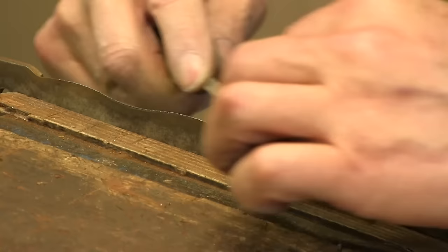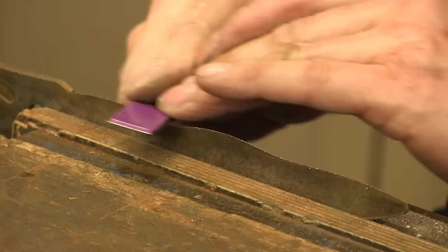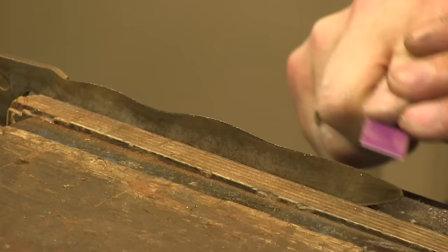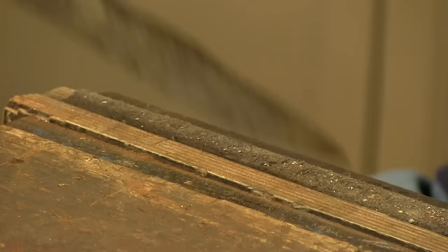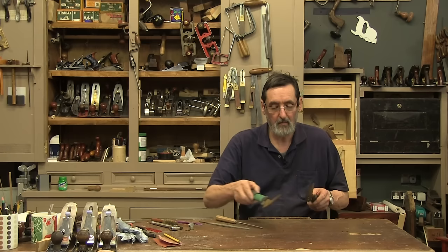You can draw file here all the way along this edge to refine it. If you have diamonds just go in; if you don't, you could wrap a piece of sandpaper, but the problem with sandpaper is it's going to round this edge. Flip over — you could just use your file, go along here, just take off that burr off the inside face without lifting up. And now these are very sharp — feeling very sharp.